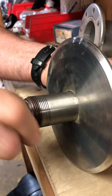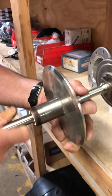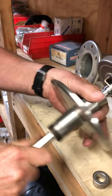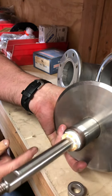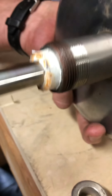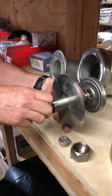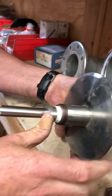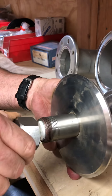So what's the packing look like and how hard is it to change? It's not hard at all. If you just turn this out, you can see the packing will actually start to come out of the inside. This is what the tank washers are doing — they pull this out and the packing comes out right here. Now that packing can be replaced and should be replaced at the tank washes. It works just like the packings on the pumps. As you compress it, it becomes tighter to the shaft. A lot of times what you'll see is they will not tighten it up and it won't thread on.